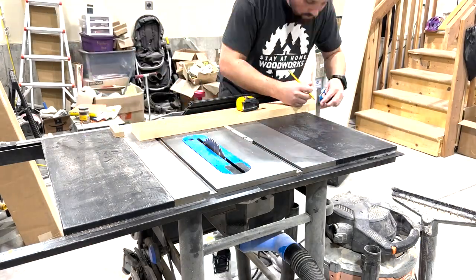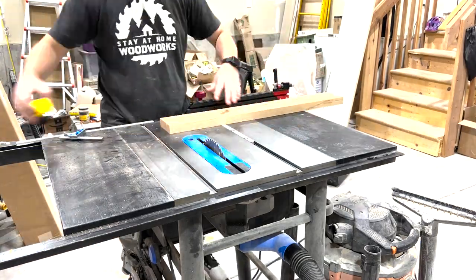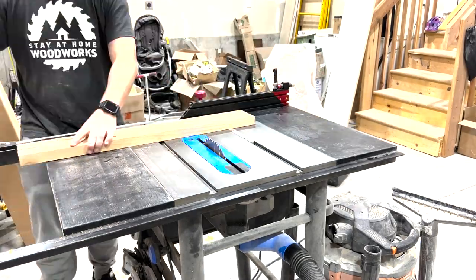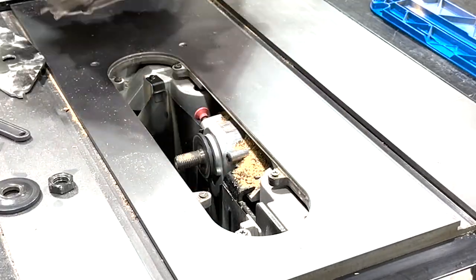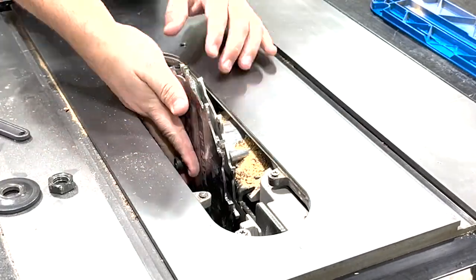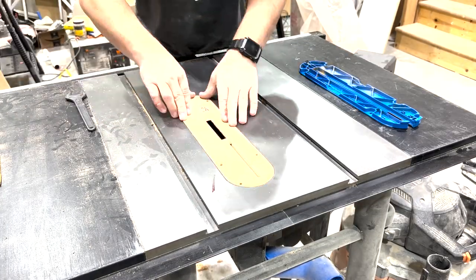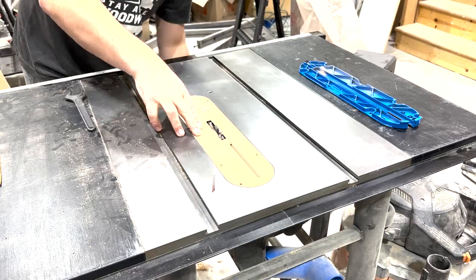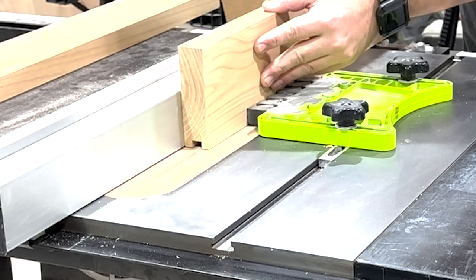Now that the milling is all done, it's time to cut the rails to length, taking into account that I'm doing a tongue and groove system, so I need to account for the lengths of the tongues themselves. To cut the tongues on my rails, I'm going to swap out my regular table saw blade for a dado stack. A dado stack is just a really thick combination of blades, and with a special blade comes a special plate insert. But before I cut the tongues in the rails, I'm first going to cut the dados in the stiles of the door.